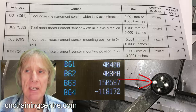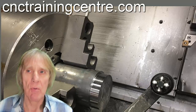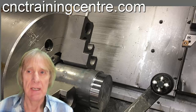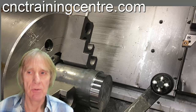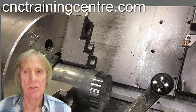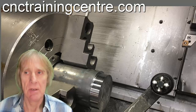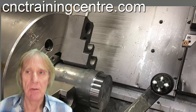Another thing on this particular machine: it's a big machine with a gearbox. There is a slight pitfall when you first turn the machine on — it won't have a gear selected. It sits there in neutral, so you have to pick up a gear. In program, it picks up the gears automatically when using the Mazatrol, but manually you need to handle it yourself.